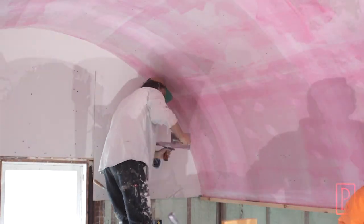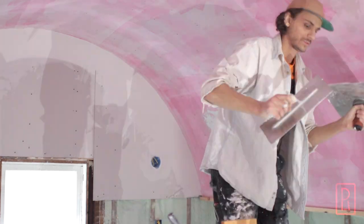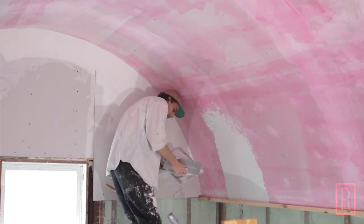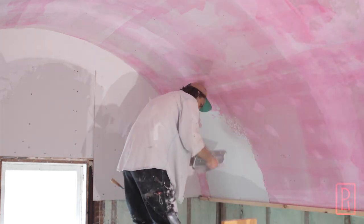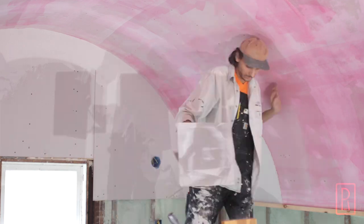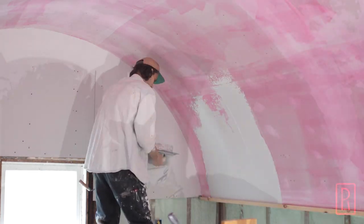The base coat material I'm using is a gypsum-based product called Structolite. This stuff goes on pretty easily when mixed properly, but it is fairly tricky to mix. It'll quickly go from too runny — which makes it very hard to lay overhead — to too sticky, which is harder to level and usually leaves a worse finish. So the mixing is crucial.